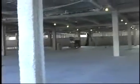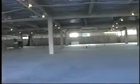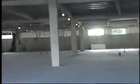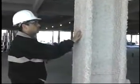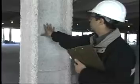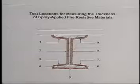When performing thickness testing, conduct measurements on a random basis in pre-selected areas in at least one bay per floor or for each 10,000 square feet of floor area, whichever provides the greatest number of tests. Testing should be done on one area of metal deck, one column, and one beam or joist or truss. When measuring thickness, the test area must be free of physical damage and have a surface texture relatively free of excessively high or low points.